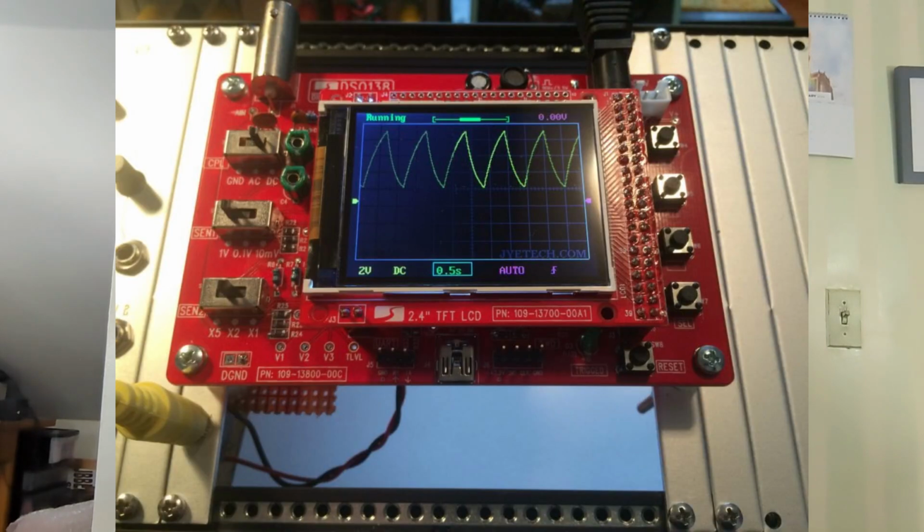So I decided I wanted to get this thing and build it, but not as a handheld scope as it was designed to be, but as a synthesizer module. Now, this has been done before, something like this. If you go to the AI Synthesis webpage, there's instructions there for basically taking a DSO138 and screwing it to the rails on a Eurorack synthesizer, and they add a 3.5mm input jack for patch cords, and they add a Eurorack header with a 9-volt regulator to supply power to it. It's kind of rustic, but it works.